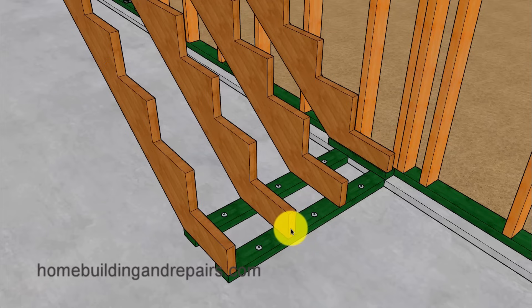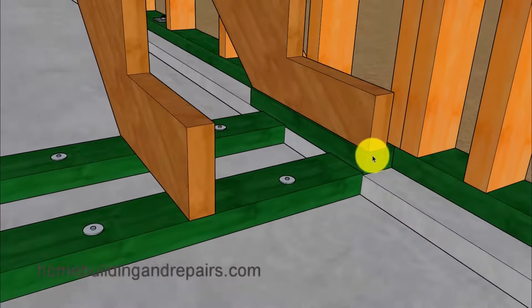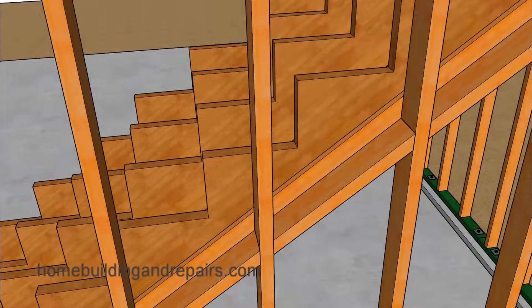The stringers will connect to the floor with pressure-treated lumber using shots and pins or other framing anchors to securely connect the stairs to the concrete foundation. You will see that this stringer is going to be sitting on top of the stem wall — however, you could always move the stairway over a little bit if you don't want this. There will just be a small notch in the lower riser in a section where no one is ever going to step, but you might need to approve that with your local building department. We are also going to nail a three-quarter-inch spacer board for our drywall, providing a slot to drop the drywall into so we don't need to notch around every single step. Fire blocks will also be required for the stairway.